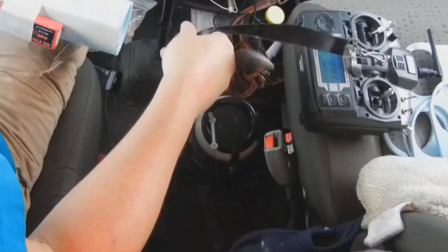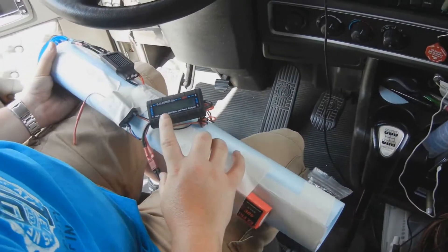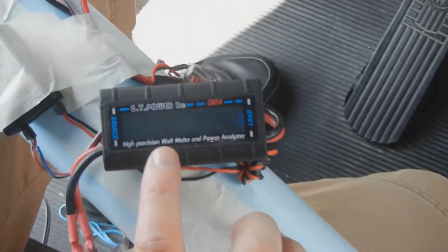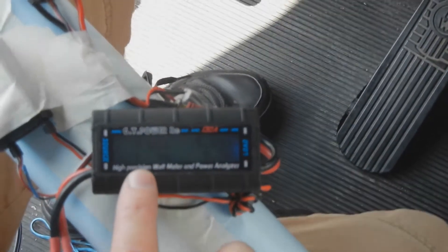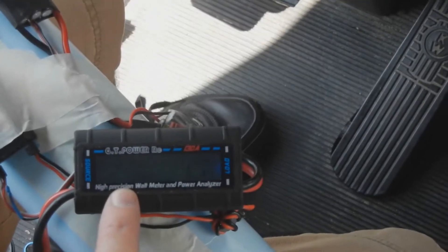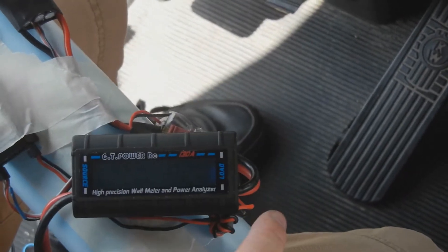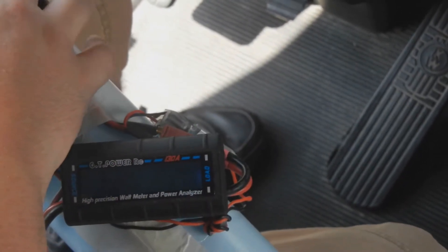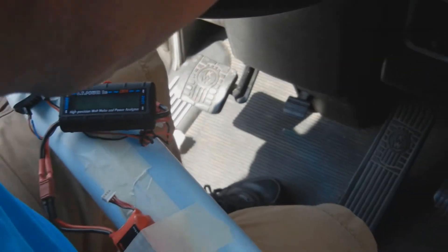It's going very good. Can you zoom in right here? We can see it real clear. It says 599.9 watts and 52.9 amps. So this 60A ESC is fine with it — it's not even close to temperature warm at all. It's getting pretty good thrust out of it.